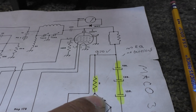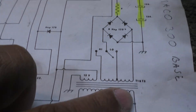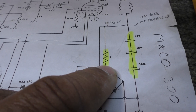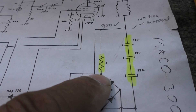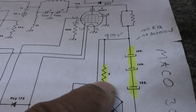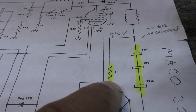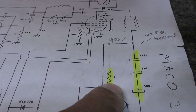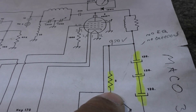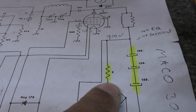When you turn on a lot of amps and the lights dim, that's the surge of the caps charging up, because they look like a dead short to the diodes and to the transformer until they get some charge on them. Here are the caps over here in yellow. Some amps — the Pride DX300 does it too — they just put a low-value resistor in line to handle that surge. When that surge hits, before these caps get some power on them, that resistor takes a hit. It's going to have that resistance to only allow so much voltage or power into the caps. Once the caps are charged, the dead short kind of goes away and they're operating at normal voltage and current, and it's not pulling on that resistor so much. Since the resistor is such a low ohm value, it's pretty much no longer in effect.